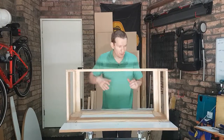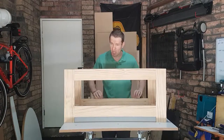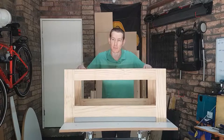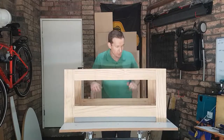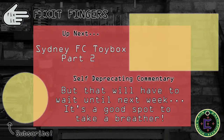Let's try and get the rest of these glued in today and then make some noise cutting the MDF bits. Before I do that though, I think I'm going to use the router for the first time, because these edges are really sharp. Steve's build was designed as an easy, really beginner's project. And while I am still a beginner, I am going to tart this up just a little bit by rounding over some of these edges, just to make it a little bit gentler on young hands.